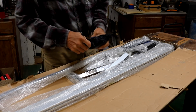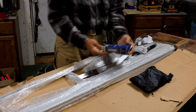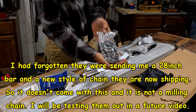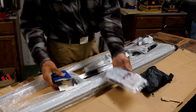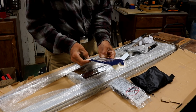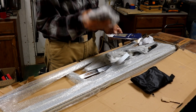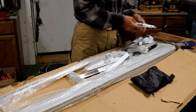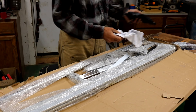And it comes with a milling chain. I don't know what size that is. This is a 28 inch, 92 drive link, 3/8ths, .050. Well, I can put a 28 inch in this. It was nice of them to send me this — I don't think that normally comes with it, but I'm not positive. I don't know that it's a milling chain, but they were sending me a 28 inch chain. Apparently they stuck it in the same box — they wanted me to try out some of the new chains they're carrying.